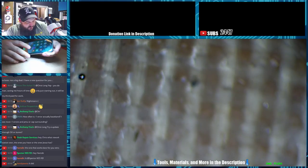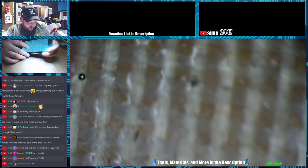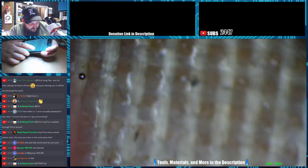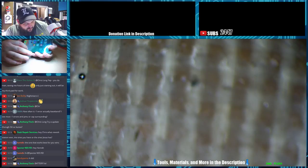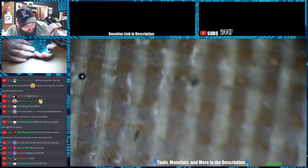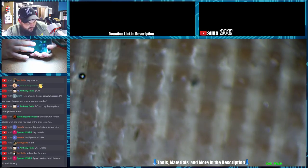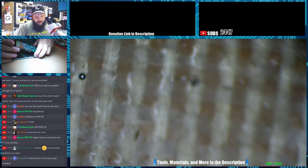Now the battery percentage is reading very low, which is odd. Because usually with this plugged in, it reads like 80-90%. Right now it's reading very low. Now it's up to 50%. Okay. So, I don't think the issue is that it's boot looping. I think we have a power problem. I did touch IC on this one, and supposedly it was boot looping a couple weeks later. But I think it's battery. Alright, so I'm going to take this one off of power. I'm going to shut it down.